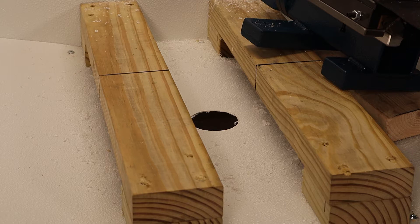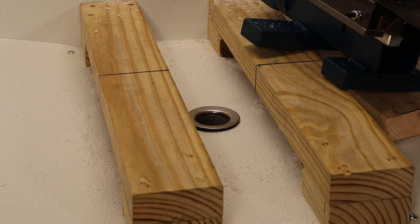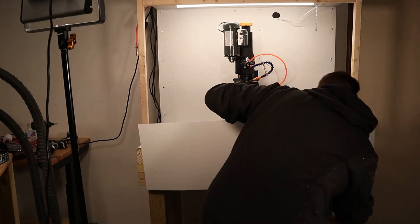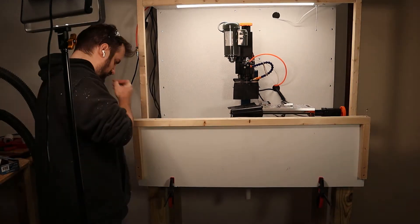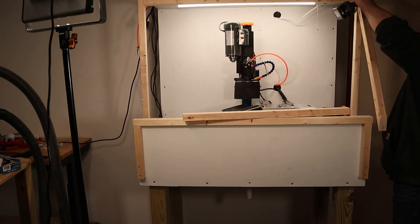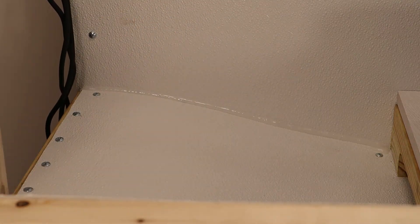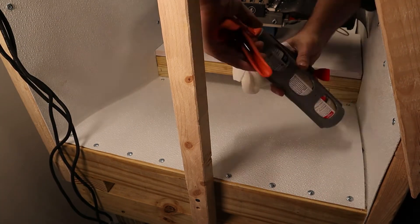Let's drop a 2-inch hole in for the drain. This was just a dry fit — you actually need to put silicone sealant all the way around because otherwise you're going to get leaks. The more time you put in now sealing the enclosure the easier things are going to be, so while you've got that sealant in your hand make sure you tackle everything you possibly can. Let's get the front on — there's another piece of that same white sheet, one of the last pieces remaining. I framed it up with some 2x2, then cut the angles correctly for the taper at the top. Be very careful with sealant — you need to actually remove those middle pieces, because if you don't, you're going to get leaks.